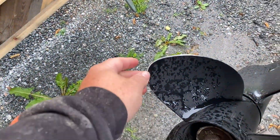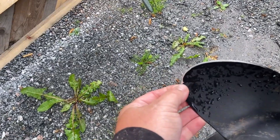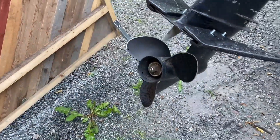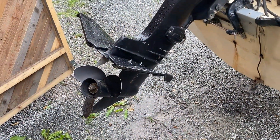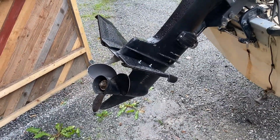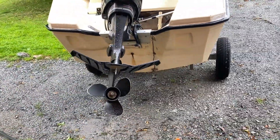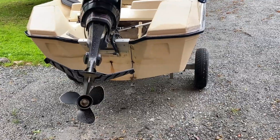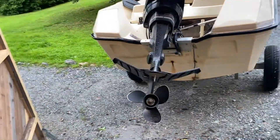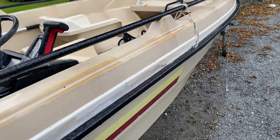I filed the prop down — it had a few jagged edges, but I filed it down so it's nice and smooth. I've tested it in the water and it's a lot more stable at low speeds. It picked up a couple of knots at the top end, it's planing a lot quicker and a lot easier. So I'm really happy with mounting this, and today I'm going to do a few small modifications.